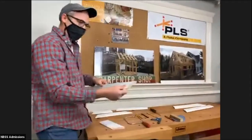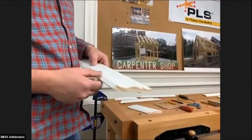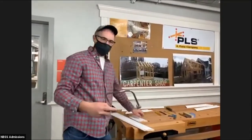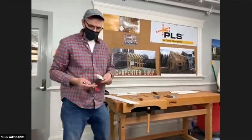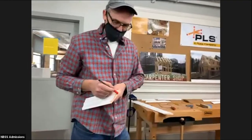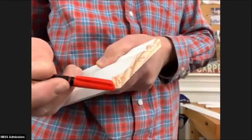I have a couple of pieces of crown molding. The first thing you're going to do is cut it on the chop saw — you can see that I have an angle cut through the crown molding. Next, we're going to use the coping saw to cut along that profile. We have to cut up one angle, then come in and cut a second angle or second track, then a third time, and finally a fourth. So there are four cuts.